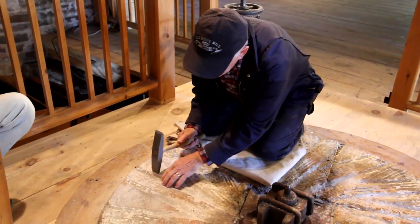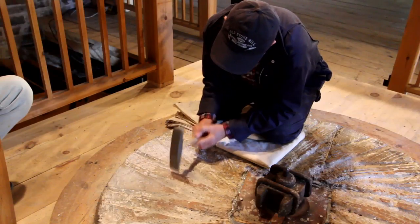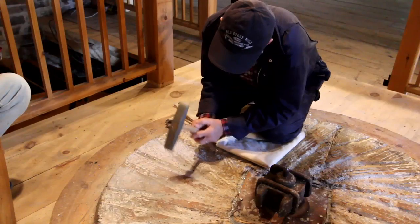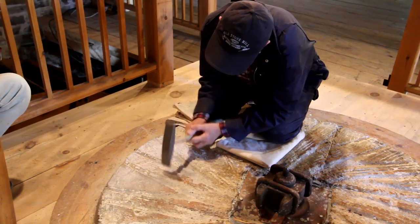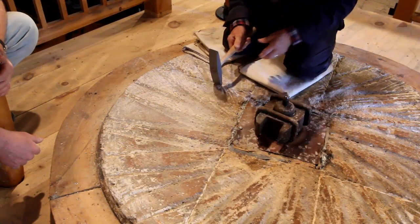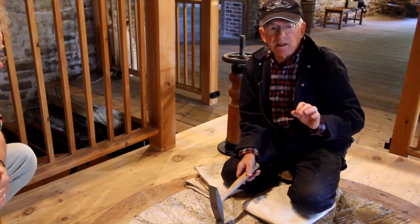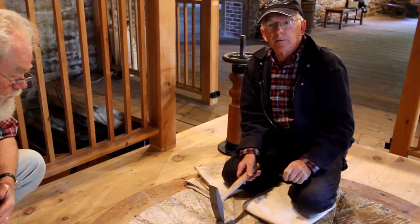The idea is to make the lines as straight as possible — not easy if you've had a few drinks! The goal is to break that glaze which has formed on the stone; it is like shattering glass. When the mill starts the stone again, the first few pounds of flour are discarded because there could be leftover stone chips. Also go easy with the pressure between the stones at first, because the stones will be really aggressive and milling much faster.